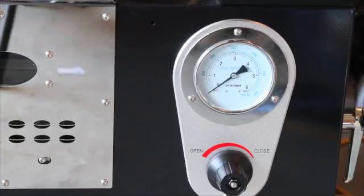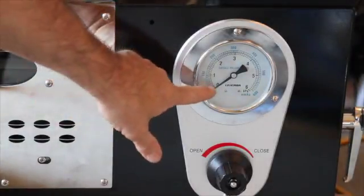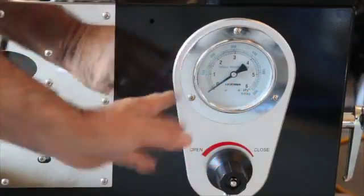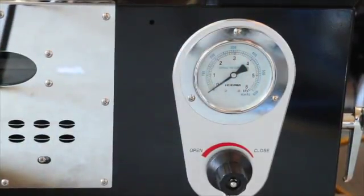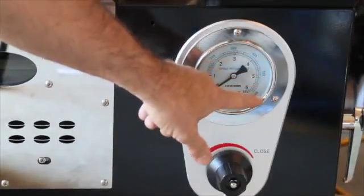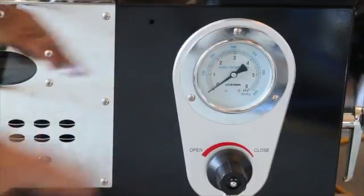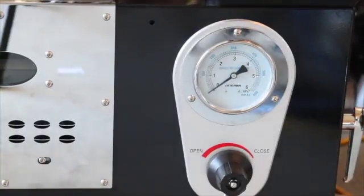The model we're using today is a propane or LPG model, and you can quickly tell when you get one because the propane model will have a gas gauge that goes from 0 to 6 kPa. You never want to go past 3 kPa when you're roasting with any of our Oro roasters or Phoenix roasters. On the natural gas one, the gauge only goes up to 2.5, since most natural gas stays between 1.5 kPa max. A lot of roasts are done below that, since natural gas is a lower pressure gas.